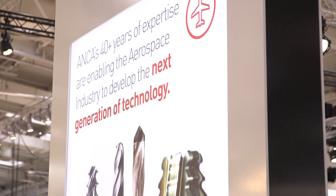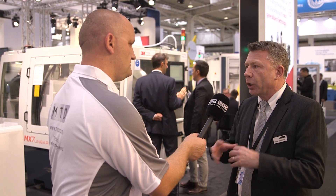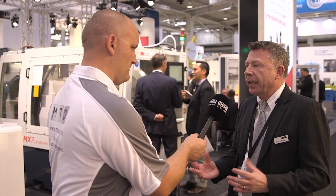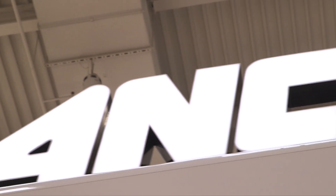And it's got automation with a difference as well — RFID. Yeah, we've got automation with a difference. The RFID unit is essentially for programming quickly and on the fly. We've integrated an RFID system into our machine and loader. So essentially that associates a chip in the bottom of a tool carrier, linked to what we call a TOM file, which is a grinding program. An operator can set up a batch of tools in any diameter, in any order, very quickly, and the RFID system does a lot of the work for you.